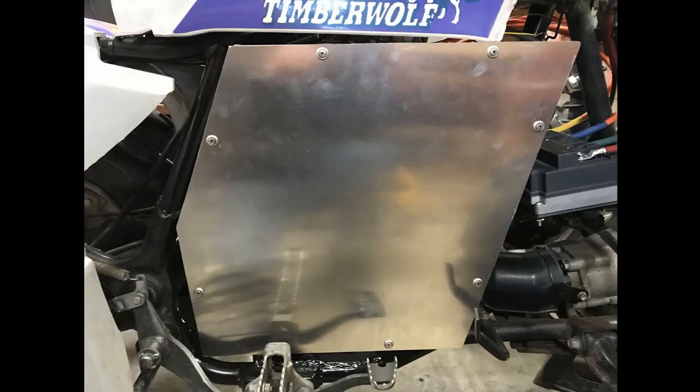This is an inside view of the battery cover. I use 1/8-inch thick by half-inch wide high-density foam around the perimeter to seal the box lid, and quarter-inch high-density foam in the cover center for insulation and to hold the battery modules tightly in place. And lastly, here is a picture of the completed battery box with the lid installed. Thank you all.